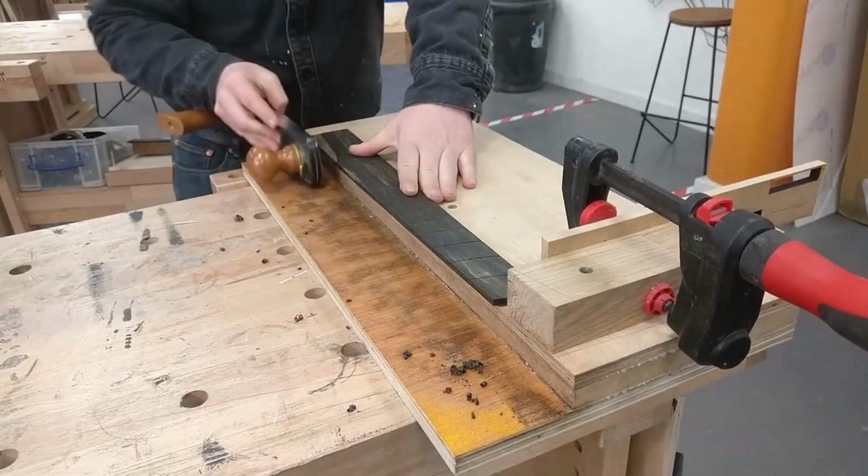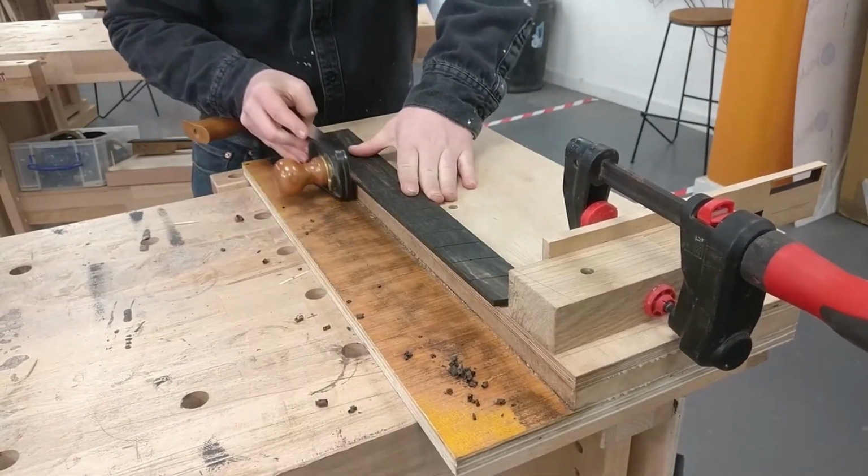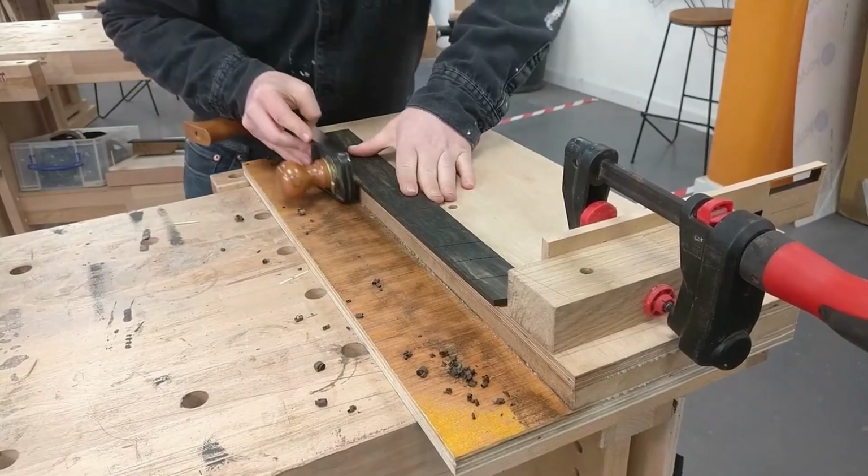They are really, really useful. They are beautiful on a shooting board, and they are really good for just general everything. Because they're a jack plane, they are a jack of all trades. If you've got something that is being difficult, a low angle means that it'll cut a bit easier. It may risk tear out or may not like figured woods as much, but it will cut beautifully. I know you can get them with different blades that will transform it effectively from a low angle to a high angle, which will make it slightly more difficult to cut, but will deal with figured woods much, much better and prevent tear out. Really, really good planes to get. I would recommend it, but I would not say it's essential.